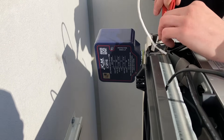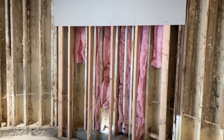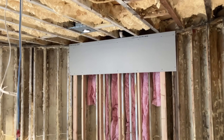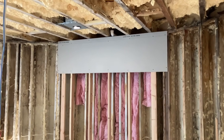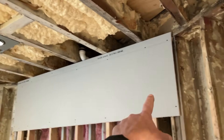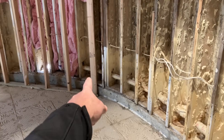We are in this room — it looks like the spray foam machine vomited in it. Spray foam was injected into the cavities of these walls and ceilings. There have been leaks; those leaks have been fixed. We have this curved wall that goes all the way around — this is going to be the homeowner's office. The general contractor built a wall here with a piece of plywood and we're going to center the indoor unit on it. We're going to utilize that chase where the two-inch PVC is — we'll rip that out and run our line set, communication wire, and drain through there.